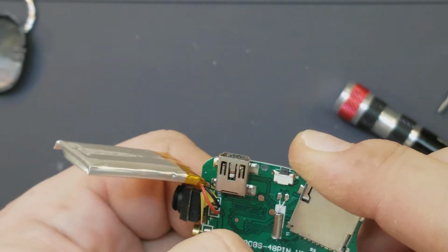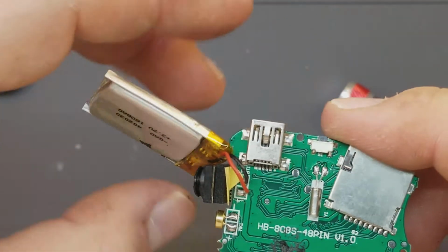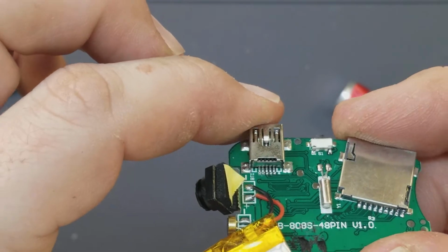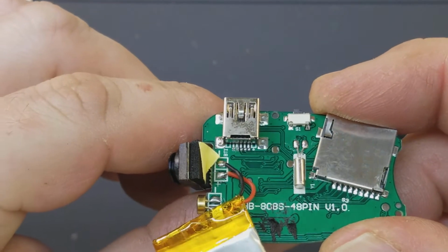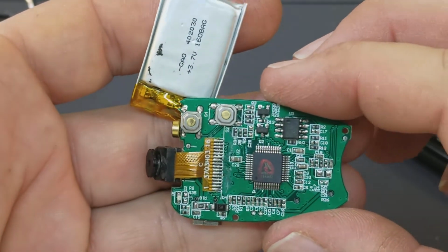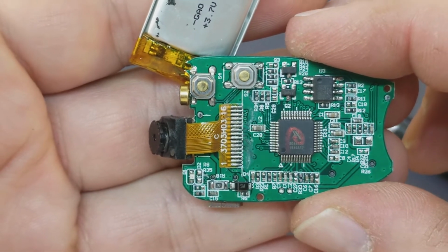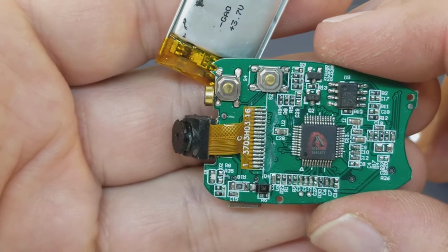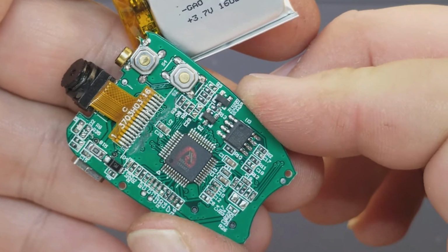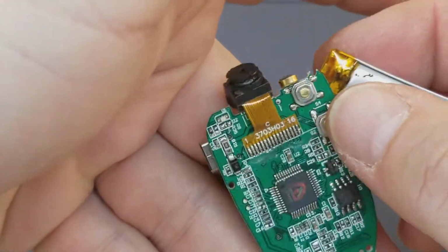Let's see, let's get that part number exposed. I don't know if anybody will ever actually need that, but now you have it. SD card. See, those are kind of, I don't know, I might just tap them with the iron. And now here's the working side. And I'm positive that's a purpose-built chip. There's some sort of, it looks like an I2C EEPROM, but maybe not. I can't read the number. Okay, that's a serial EEPROM, 25S40.